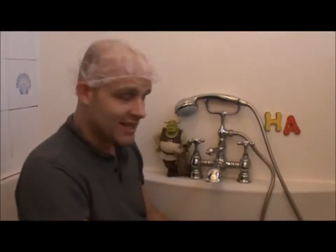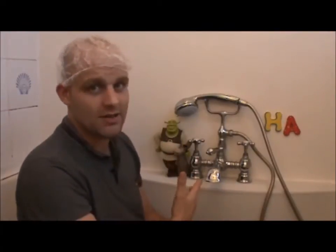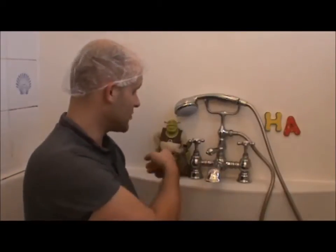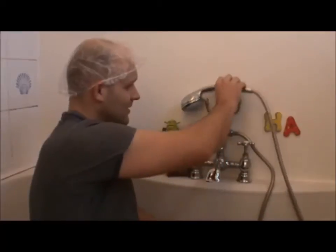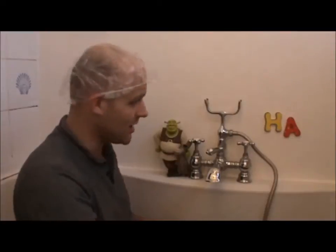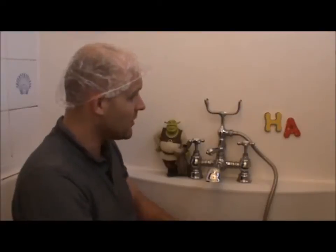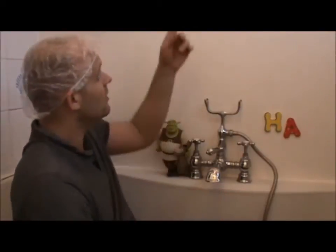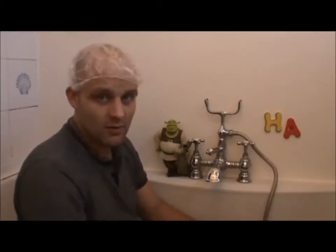This installation is illegal because it's a mixer tap with a shower attachment. If the shower head was to fall in the bath while a fire engine or a leak happened in the street mains, back siphonage would occur. To overcome this problem there are various ways: fit a retaining chain on a rail so it won't reach the spillover level, or you could fit some form of HA screw-on device.